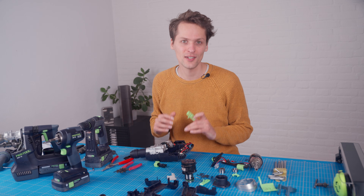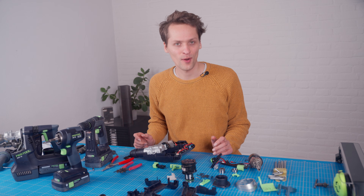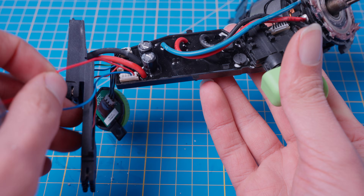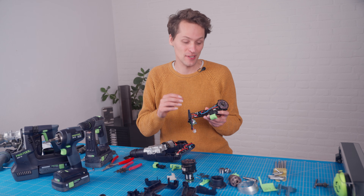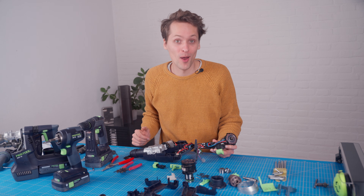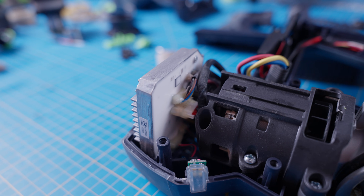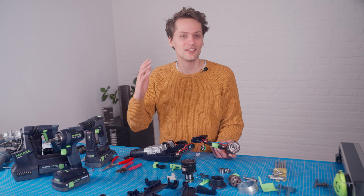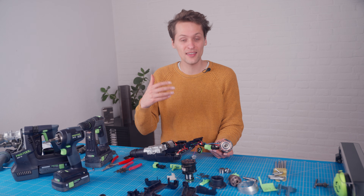The electronics are usually nicely epoxied in — called potting — increasing resistance against dust, vibration and water while keeping cable connections accessible so parts can be replaced. These solutions are really clever: at some point someone thought, if I just pour a whole bottle of glue on top of this PCB it might actually solve all my problems. Of course it didn't work the first time — you still have to get the heat out and deal with many other problems. Don't underestimate the creativity needed to come up with a working solution like this.